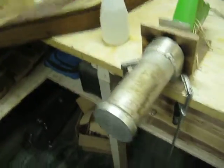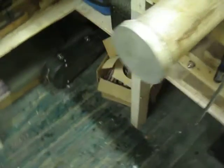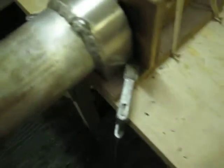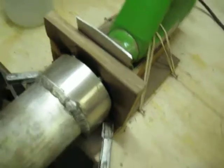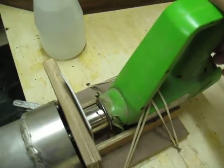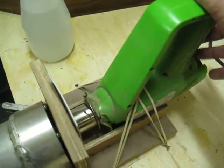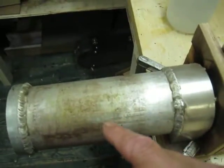Now today, bending. A lot of ways to bend. I have a simple aluminum tube, plate welded in front, something welded in the back to keep it on this little wooden frame, and in the frame, going into this hollow tube, is this heater. Makes a lot of noise, has 2 positions, half and full. That way I heat this tube.